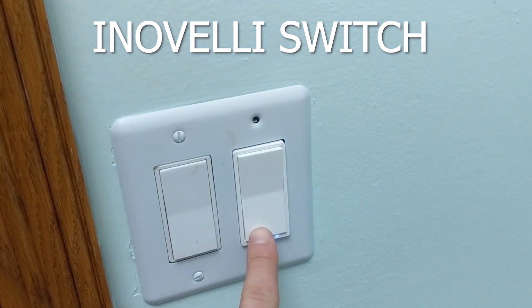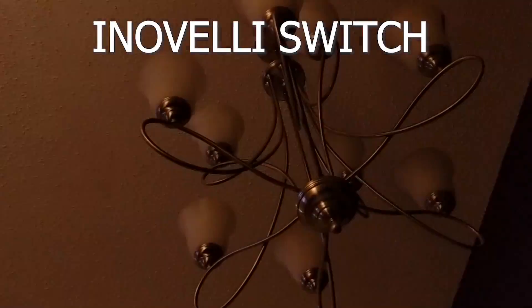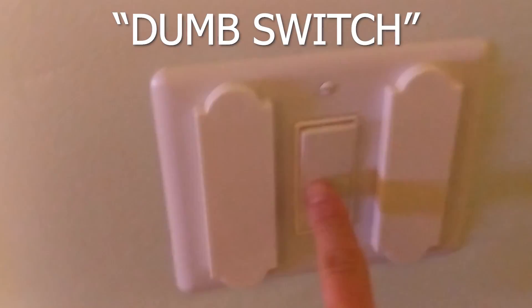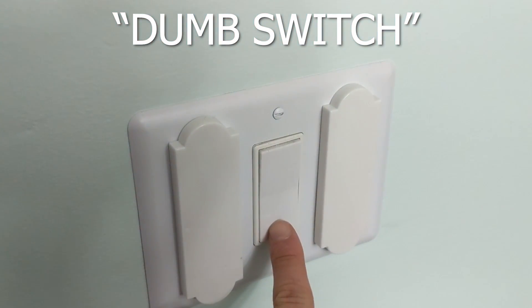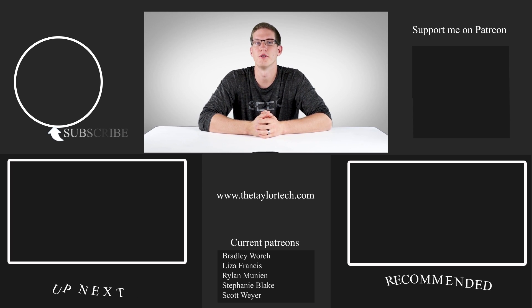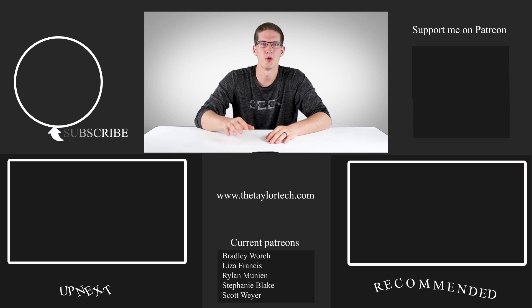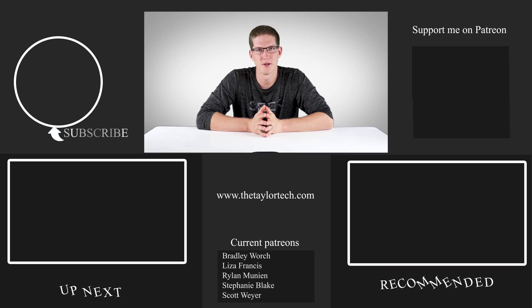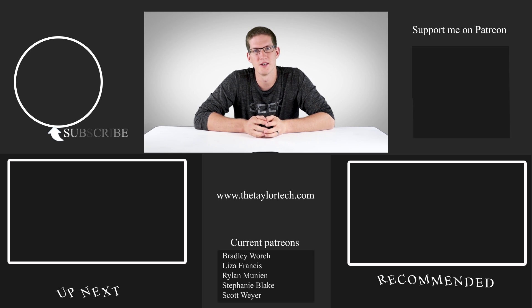Another key feature is the ability to install this on a three-way or four-way system without having to replace both or all three switches. You'd only need one Inovelli switch and one dumb add-on switch to make that a true three-way switch, and that dumb switch will actually be able to control the relay within the Inovelli switch. Not to mention, you'll be able to add up to 10 different scenes on the switch itself. Check out the next video for more details on the scenes, that internal relay, and the three-way setup. This video is sponsored by Inovelli — thank you for watching and I will see you guys in the next one.